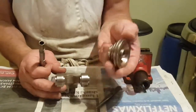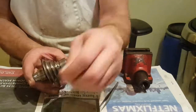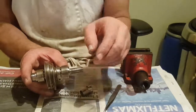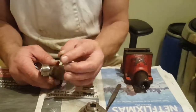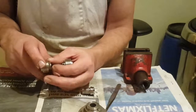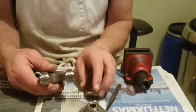It's pretty simple how to put together. The pulley will go in the middle, the spindle will go through. This part will go on the other end, these on the outside. Sometimes you get some dust covers that are thinner than these, usually made of brass, that go on the inside — remember to put them in as you're assembling. They are just dust covers; they stop bits of rubbish getting in between the bearing and the spindle. In this case I haven't got any.